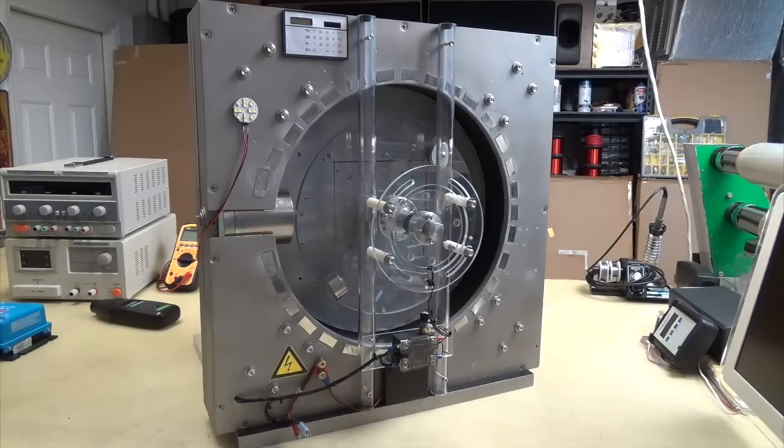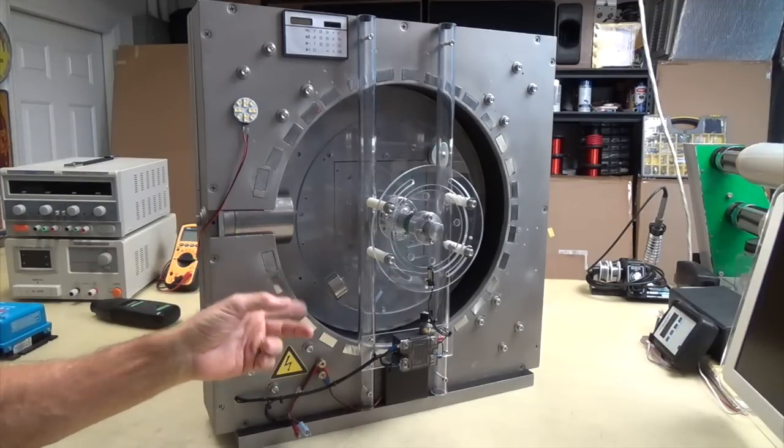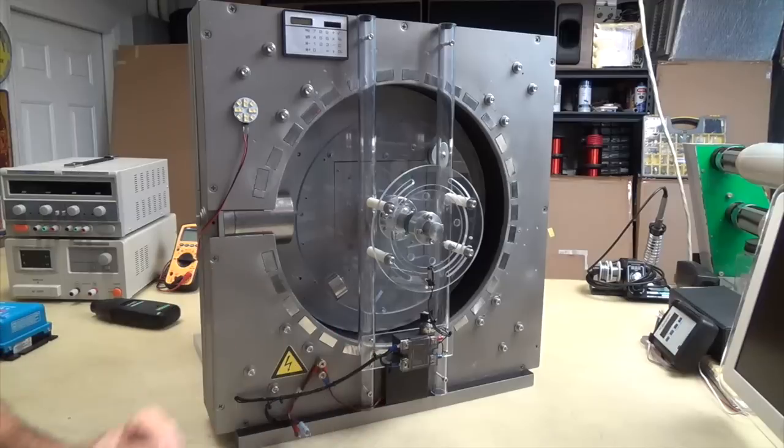It's kind of sad because they all share these similar flaws, and one of the biggest flaws that they share is trying to close loop the magnetic stator. And you just can't do that, because if you do that, the rotor and stator relationship will reach this point of equilibrium where it just slows down and stops.